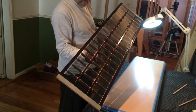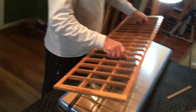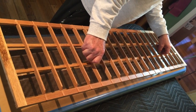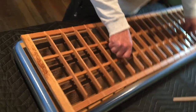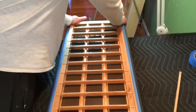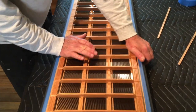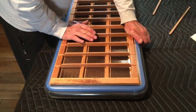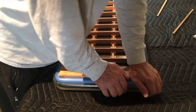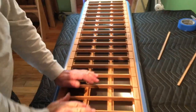I've got my stator ready to go with the backing off the double-back tape spacers. As soon as I set this thing down on the Mylar it's going to bond, so I have to make very sure I'm in exactly the right location before I drop it. Looking good on this end, looking okay here. Now I'm going to start applying pressure around the edges so that double-back foam tape sticks itself to the diaphragm. I'm going to go all the way around and put a lot of pressure. The Mylar is stuck.